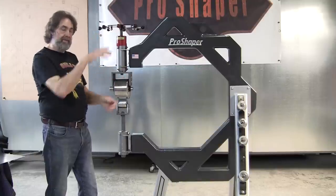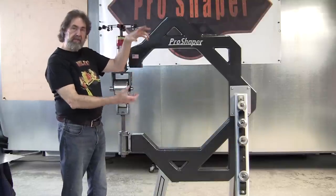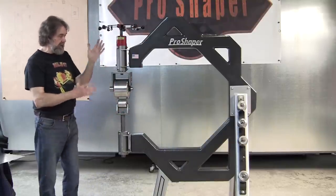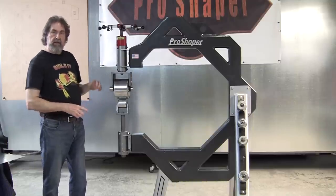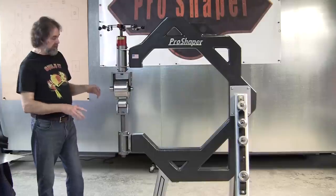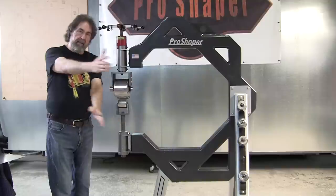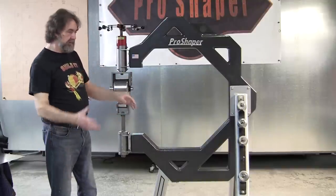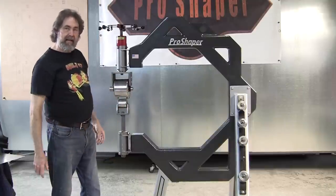because the frame would not give. Now, that one you definitely need a little bit of elasticity in your frame, but you don't want too much that will cause elasticity in this rotational way here. This arm and this arm rotate, so that will cause the wheels to misalign. And then also the arms can go like this, and you don't want that to happen either. So if you make your frame strong enough, you limit this, you limit that, but this, it has to have some movement in it.